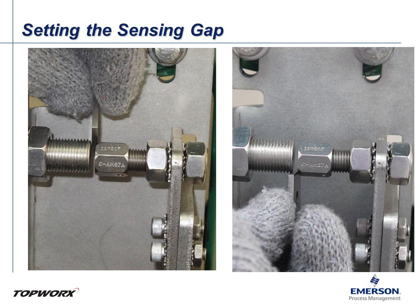To set the sensing gap, first reference the maximum sensing distance available in the IOM. In this case, for the C7 nuclear switch, it is a tenth of an inch. Using a feeler gauge equal to the maximum sensing gap, check 360 degrees around the axially aligned switch and target as seen in the pictures. At no point should the feeler gauge come between the switch and the target. There is no minimum spacing specification, but the switch and target magnet should never come in contact with each other. However, the closer the target magnet, the stronger the contact pressure.